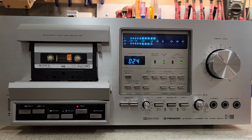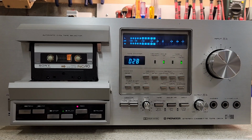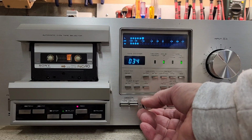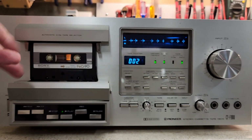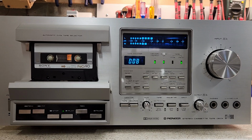See how that has a completely different effect on this kind of tape than it did the other tape? Having it at zero pretty much sounds the best, or maybe really warm to the right. But far left attenuates it. So let's listen to that and see how that sounds on playback. Now notice I have left Dolby in. I'll take Dolby out here so that you can hear the difference, but that will make a very slight difference with highs.